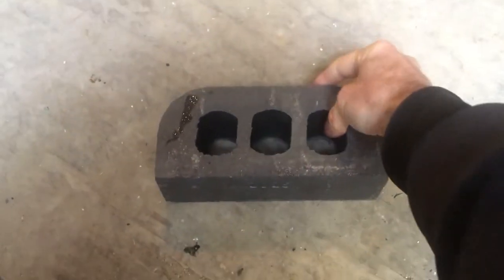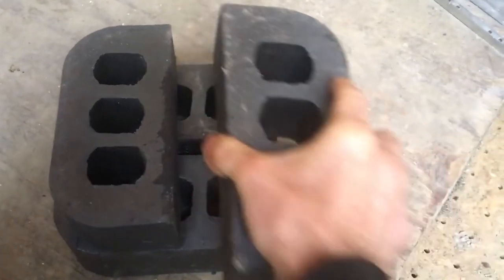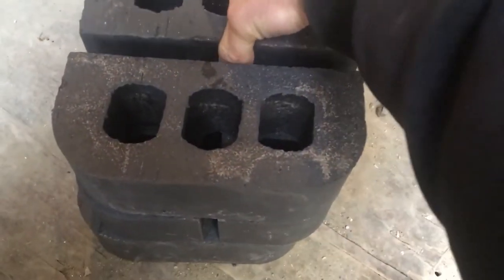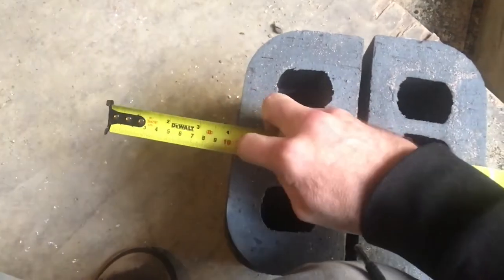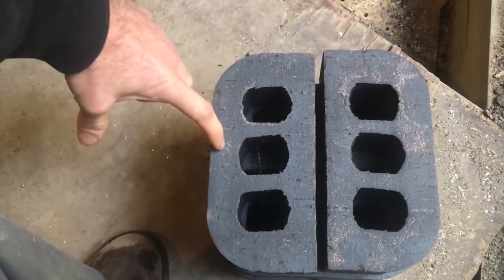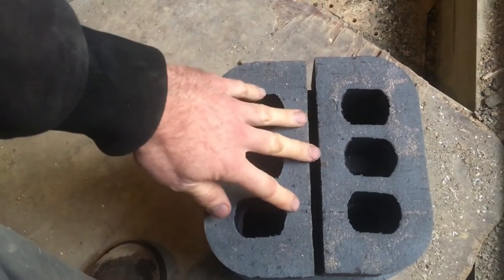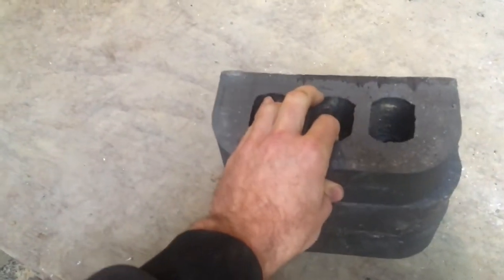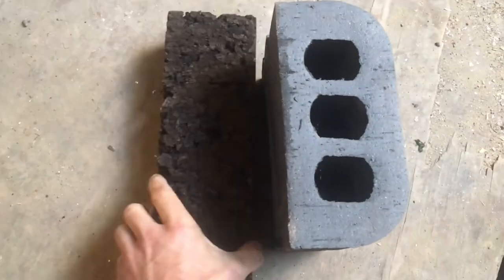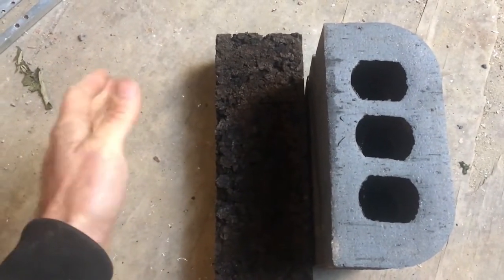If they were real brick columns, they'd be bonded like this and they'd be self-supporting. But in a 300mm wall build-up, that only leaves me with 100mm here for insulation. Because the brick is cold and because 100mm isn't enough space to make up the thermal performance using cork or hempcrete, I'd end up with a cold spot here on the wall if the column was really two bricks deep.